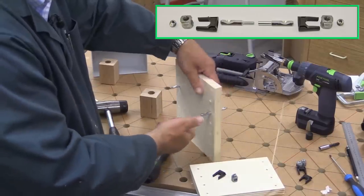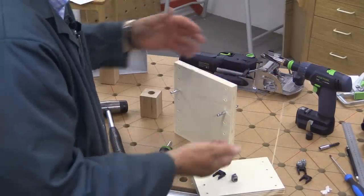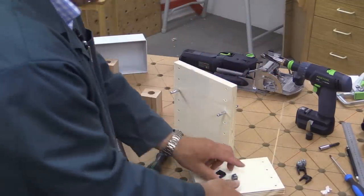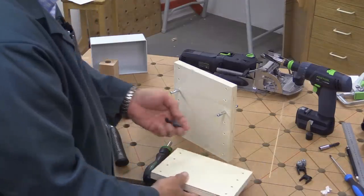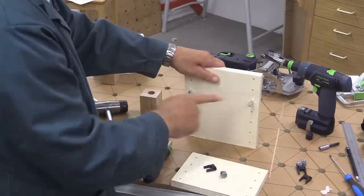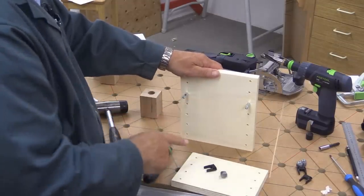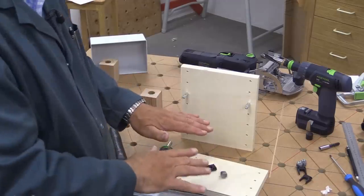This then allows one to have a pair of opposing shelves, one either side, just as we did before with the normal system. One side you'd have your panel anchor, and the same on the other side. And remember, again, you'd need to have a normal domino in the middle to give it some structural strength.